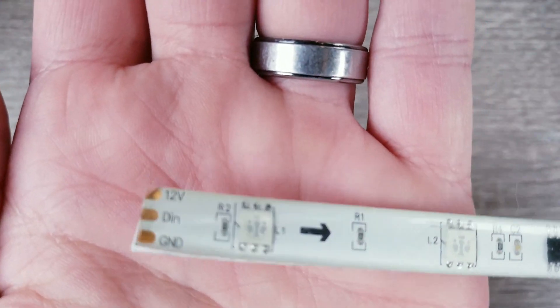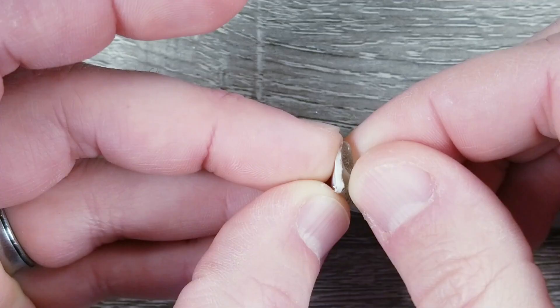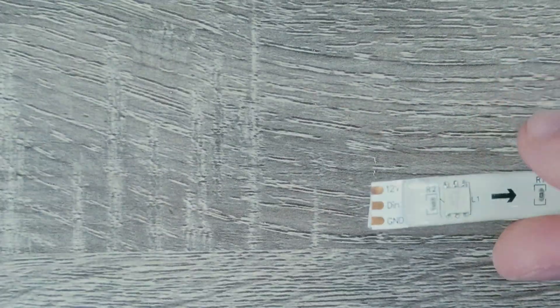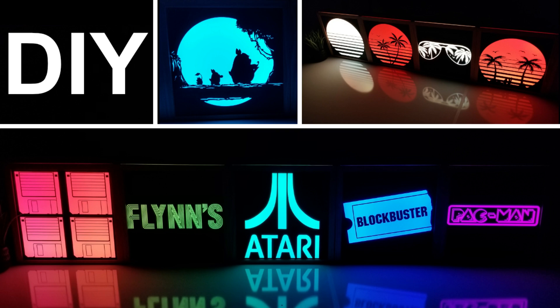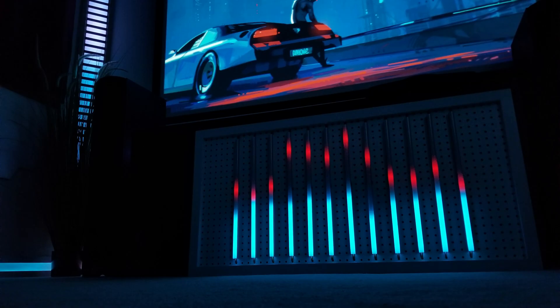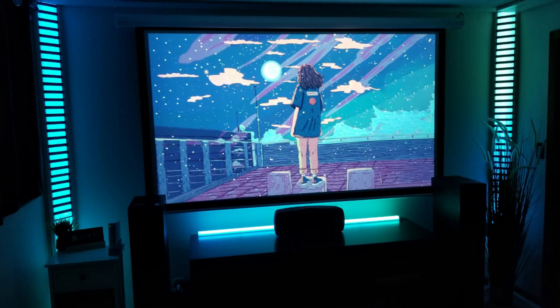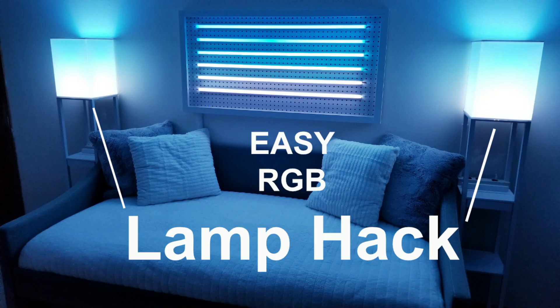The last thing I'll quickly mention is if you're working with an LED strip that has a protective coating over the LEDs, you could just use your finger to peel it back, and then you can either use scissors or just pull it and it will tear off so you can get to the copper pads underneath. Now if you're new to my channel, I like to do fun little DIY LED projects. For everything that I've made, I don't think I've had to do any other type of soldering from what I went over in this video. So hopefully that lets you know just how much you can do with learning these few basic techniques. Thank you so much for watching and let me know if you have any questions at all.